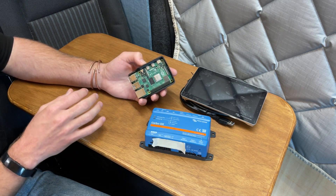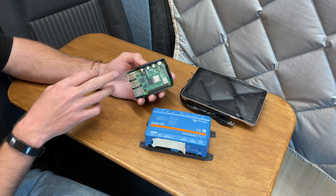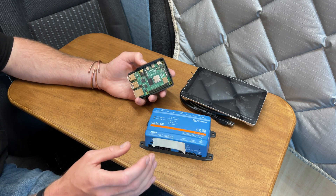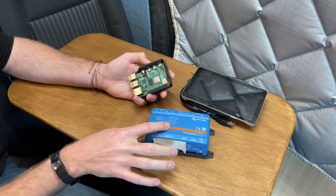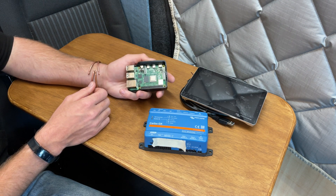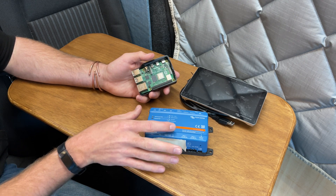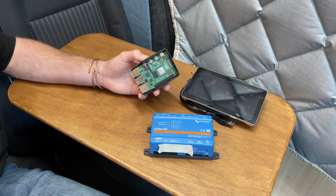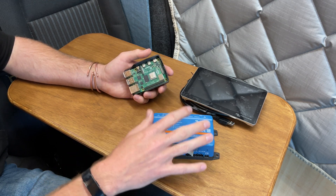With the Raspberry Pi you essentially only have the software side of it. Yes, you can plug in USB devices — a USB GPS and the units themselves such as the MPPT or Victron shunts — but you don't have options like built-in relays, digital inputs, tank sensors, temperature controllers, and many more. You can with some difficulty add those features with a top hat board on the Raspberry Pi, but it's not as simple. You can also use a third-party screen with some file modification, whereas with the Cerbo it's very plug and play with an HDMI connection. Whilst the Pi is great on a budget, I felt I could get more out of a Cerbo GX.